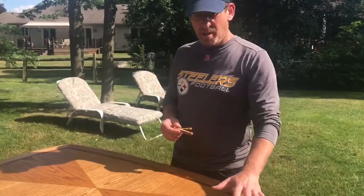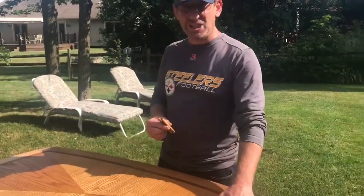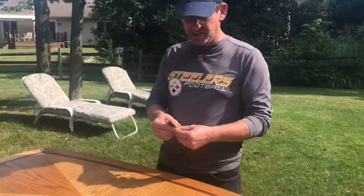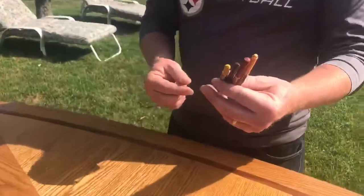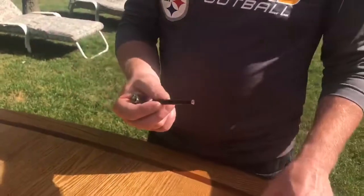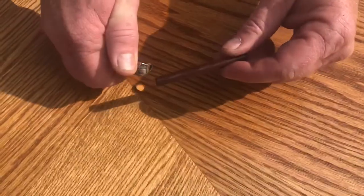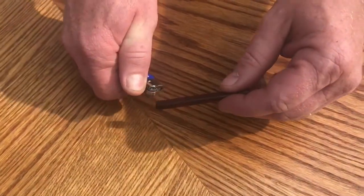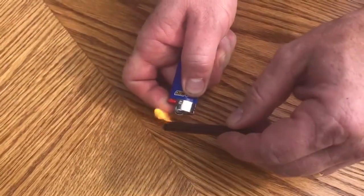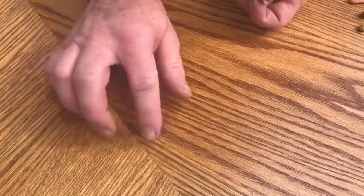I put on the Danish oil and a first coat of polyurethane before using the crayon to fill the remaining crack, because the polyurethane, even though it's clear, does yellow everything and changes the color of the table a little bit. I'm using a brown crayon - I come over to the crack, take the lighter, light the end, and drip it down inside. Once it's in there, I smear it with my finger before it cools, then scrape away the excess.